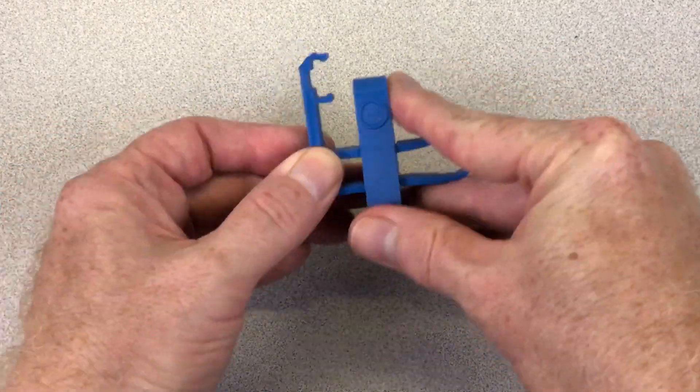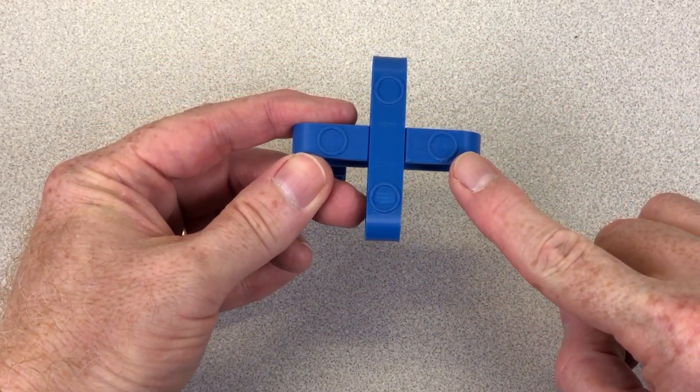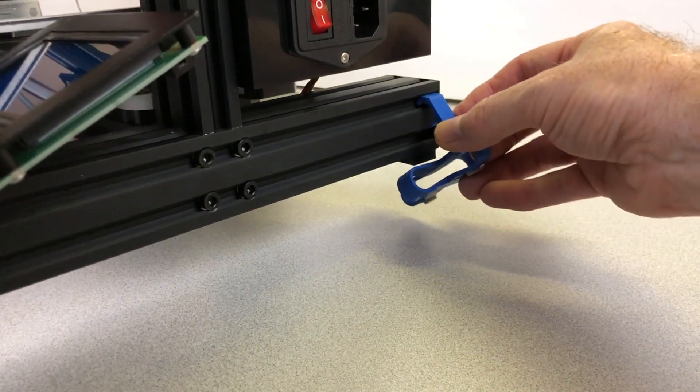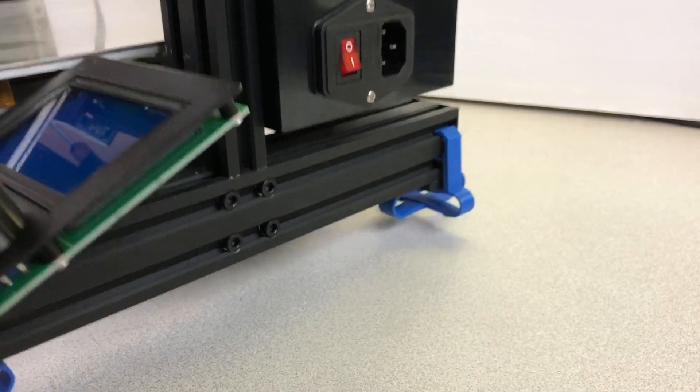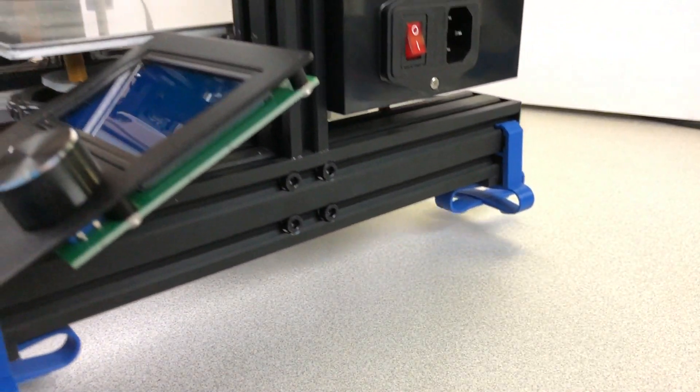Now I use the word 'may' because I haven't done A-B testing to see whether or not this actually does improve print quality, but in my mind it makes sense. Mostly I'm using this to quiet things down a little bit, but the potential for print quality improvement is a plus. These feet print as two pieces and they snap together. They've even got little places for peel-and-stick rubber feet if you've got some. Once you've got them snapped together, they snap onto the frame right over the existing rubber foot pads, and the clips keep them attached even if you pick up and move the printer. Apparently there are two different thicknesses of the rubber feet between the Ender 3 and the Ender 3 Pro, so I have links to both versions by Thingiverse users MHPrints and Shadow Panther in the description. I recommend printing just one of the parts that snaps onto the frame to test for fit before committing to printing an entire build plate of them.